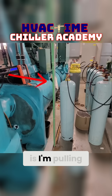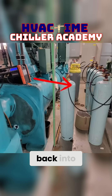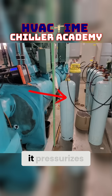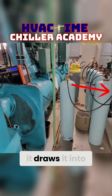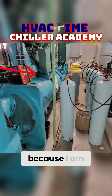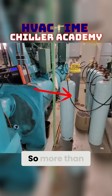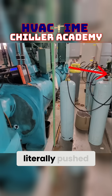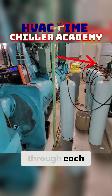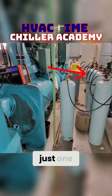What's happening is I'm pulling the vapor off of the chiller — the refrigerant that's been charged — and pushing that vapor back into this cylinder. As I do that, it pressurizes the cylinder and pushes that liquid down, which draws it into the next tank. Because I'm also pulling vapor off the chiller, there's a pulling action too. Those two in combination literally pushed all that liquid refrigerant through each tank all the way through until we had completely charged every tank with just one hookup.